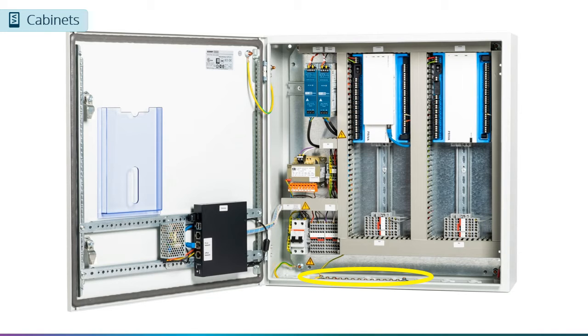We should also mention grounding at this point. Depending on where you are in the world, you may call it earthing instead of grounding. Proper grounding of the panel is needed for adherence to local electrical codes. Also, instances of erratic behavior between the compass and the different sensors have been traced back to improper grounding, underscoring how important it is to properly ground your equipment. Later, we will talk about proper grounding of shielded cables. These terminals can be used to connect the shields.